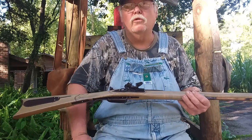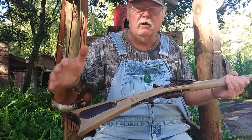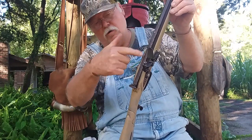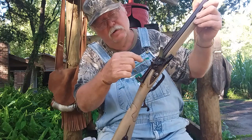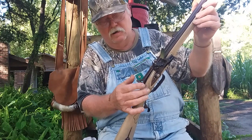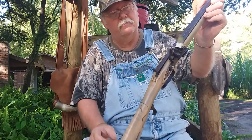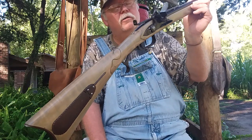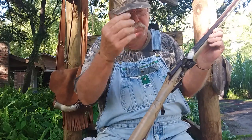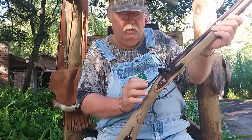I've got my forge and I do a little blacksmithing. Starting at the back: I made my butt plate, made a patch box — spring loaded, carry a few cleaning tools in it — made the trigger guard, and I made what's called a long peep. You can see it's dovetailed here, got your windage right and left, and I tapped it and put a little set screw in it so I got my elevation. This is an aperture out of a regular peep sight. I figured out what tap it was, bent this up, tapped it, and now I've got a peep sight. Looks pretty good for these old eyes.